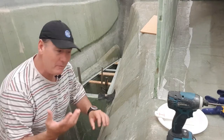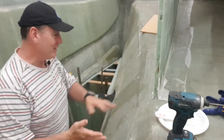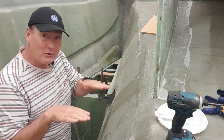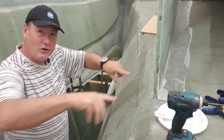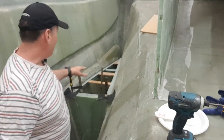So I was always worried about how I was going to seal the underside of a crash bulkhead. It's technically an airtight chamber, or watertight chamber. These angles have answered that. I basically have already put them in. They're as strong as tabbing, and then simply I'm going to put this lid on top, fair it and bog it around the outside of the radius and then just tape it in place and the job is done. It's about a half hour job.